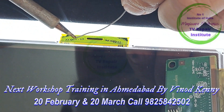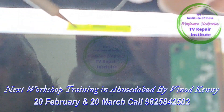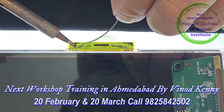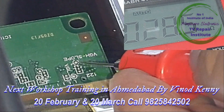This panel has a gate clock and we have to see which of the test points are not getting the voltage or signal. First I have removed the coating from the test point and soldered it. Now we have to measure the resistance between the source PCB and gate clock test points — it should not be more than 58 or 60 ohms.